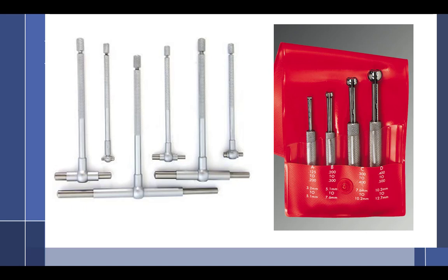Oh, and guides wear funny. They don't like to wear right here, where you guys can see it. They wear back down inside here where you can't get to it. So really the proper way to do it is to take your ball gauge, get the right one, and push it in until it's near the bottom, about a quarter inch away. Now you can go up from the bottom too, but you can just do it this way and expand it out until it just drags a little bit, and then drop it that way.